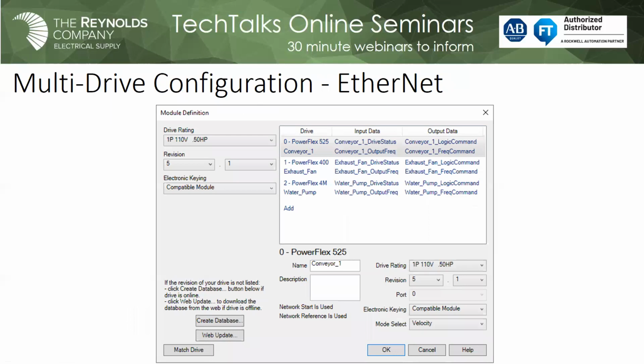This graphic here I took from Logix 5000. They actually let me use the PLC software for a day. Notice this module definition: I added a drive, my first drive there, you see drive 0525. Then I just added multiple drives. I added a PowerFlex 400 on my exhaust fan, and also a PowerFlex 4M that's controlling my water pump. I could have added 2 more drives if I wanted to. Okay, Mark?